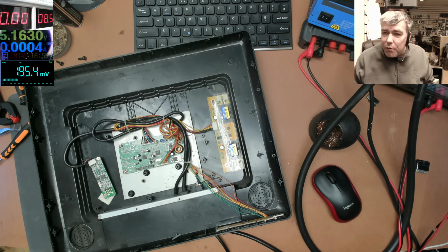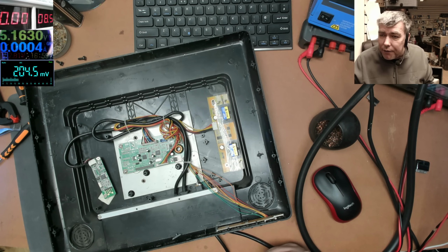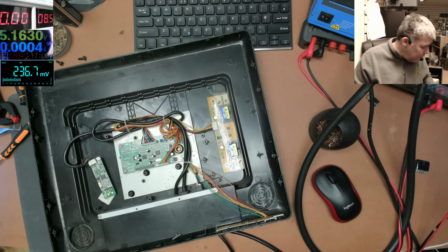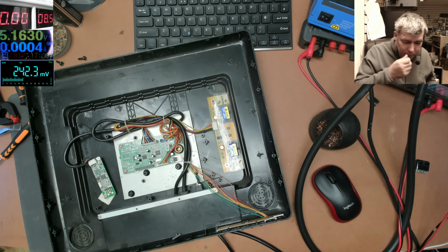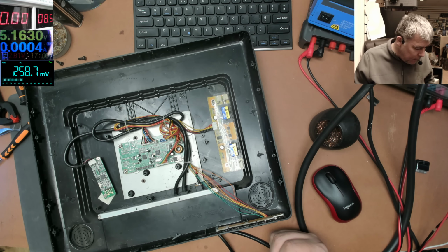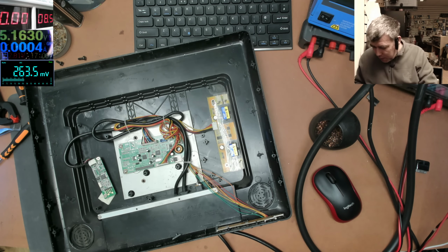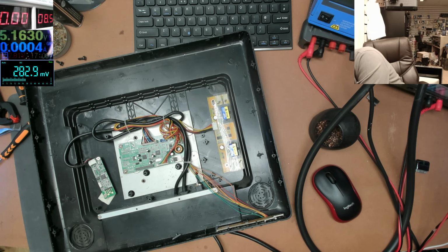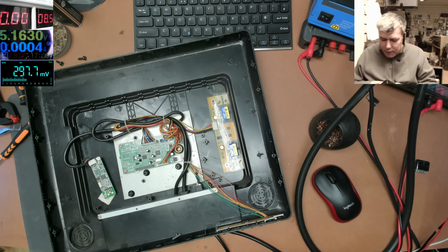You see what's nice is when you have a current limit on the power supply, so even if you do something wrong you are safe. Like I did, I swapped the plus and minus. That's why I always explain you use a current limit, because you never know what can go wrong. We are humans, we make mistakes.